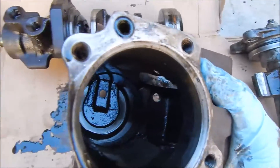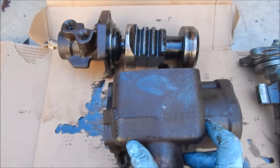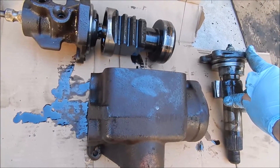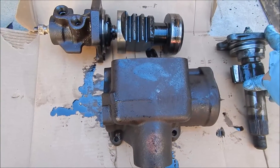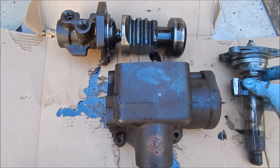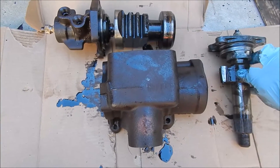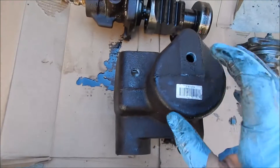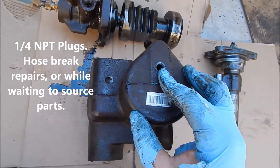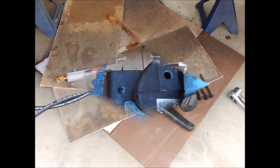I'm going to send this off to Redhead Steering up in Auburn, Washington to have them rebuild the box, because I had about 8 inches of loose play in the steering straight ahead. I'm going to have them rebuild it with all new bearings and parts as needed. They'll ship it back and we'll be able to add the hydro assist. With this, you can just put plugs in if you're not going to use it immediately — if you're going to send it in to be rebuilt — but at least this will be done so it won't need to be torn down later on.